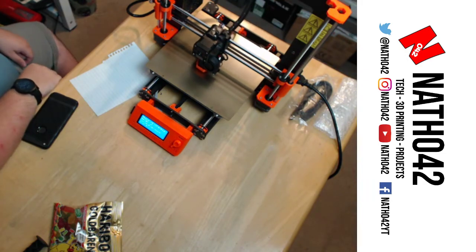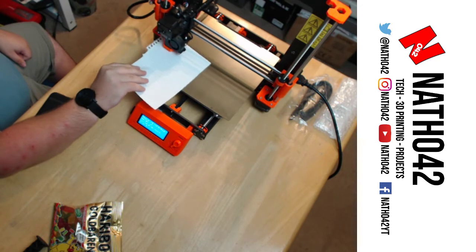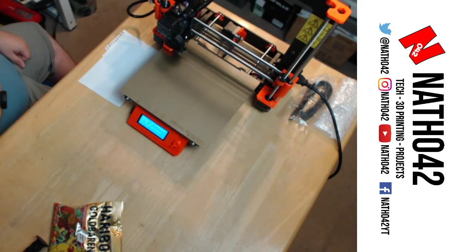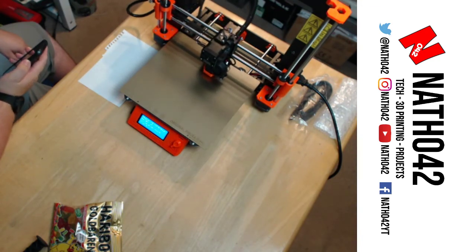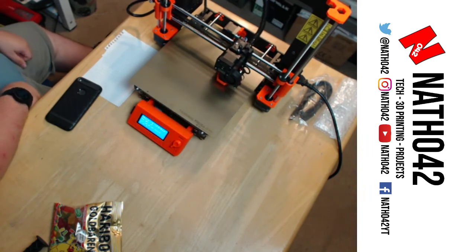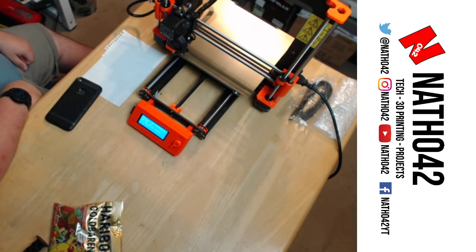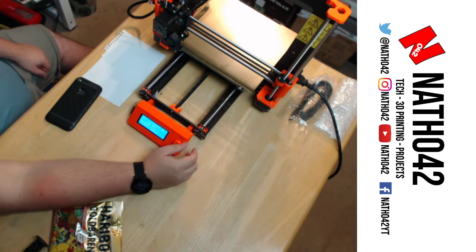I've seen that check on my ANET A8, but the thing with the ANET A8, which I find quite funny, is apparently even with that 9 reference point, it doesn't do anything. So even though it does the 9-point calibration test before you print, which is why I've turned it off now. Actually, this is why I've completely turned it off. It doesn't actually do anything with that.